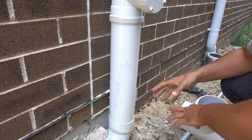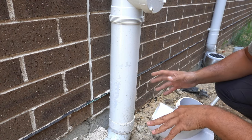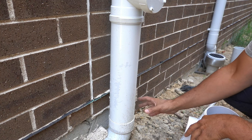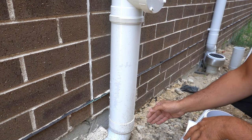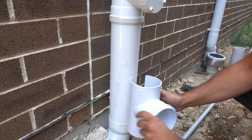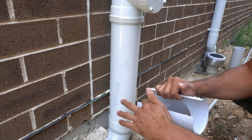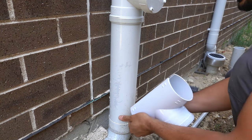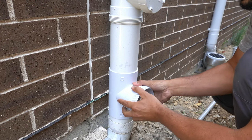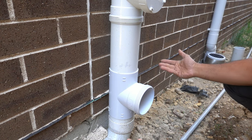This one here is just for demonstration purposes - this is our sewer and not the storm water, so make sure you always connect to your storm water or get a plumber to do it for you. You want to dig down deep enough to make sure it's lower than your pickup point. Take your snap tee, mark up the location where it's going to be positioned, drill your hole out, then apply glue to your snap tee, open it up and snap it over your pipe. Once the glue is set you can then make your connections ready for your outlet.